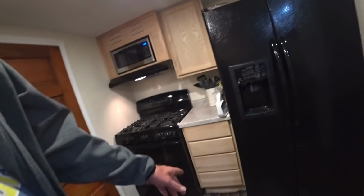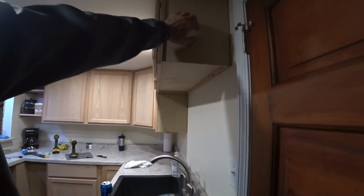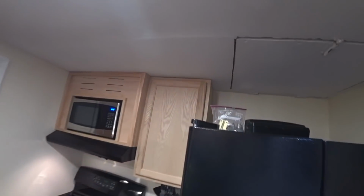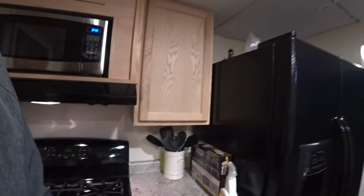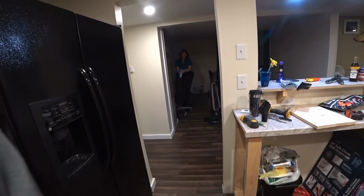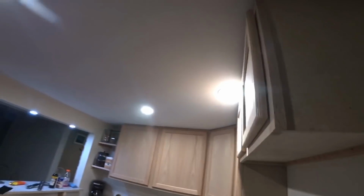And then I got to put all that real thin laminate paneling, that red oak finish on it. It's this stuff right here that I put on over here. And I got to put it all the way along the bottom of the cabinets. I got to do all that all the way around, and put it on the ends that you see. So this is all that fake wood, so I'm going to cover that up with that stuff. That'll make it flush with this. I got to put it inside the shelves. Put some up on that one, because you'll see that inside the refrigerator, and right here, and then I got to put it there, and then I got to finish the corner, the floor trim, come around that corner and come along there. And then I got the quarter round red oak trim that's going to go along the top up in the ceiling. But that'll be for tomorrow, because we're going on a special trip.